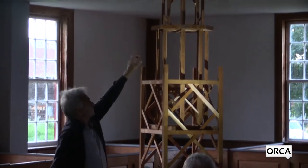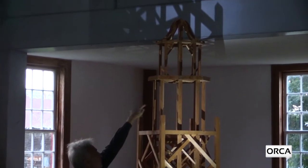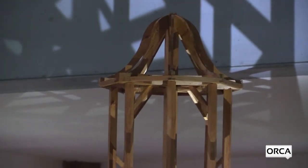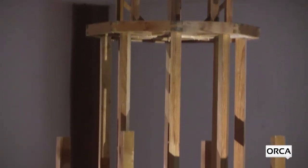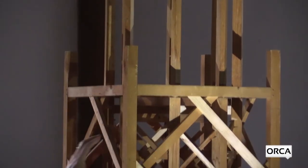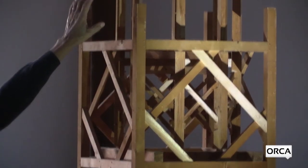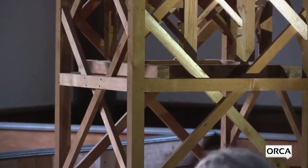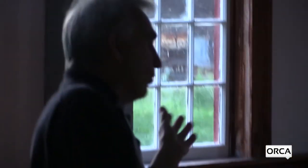But anyhow, there you've got a cupola up top, and that's set up in this case to sit on an eight-legged figure called a crab to hold it down. There's a bell deck in here, but then these columns come down through, these octagon columns, then they shift over to square where you can't see them, have concealed bracing to try and stiffen them up, but give you the illusion of airiness, and then these sit on sleeper beams that sit down in here. And that's a tip.